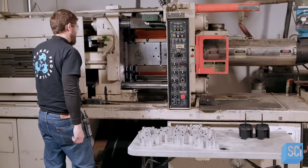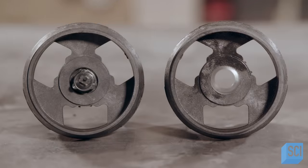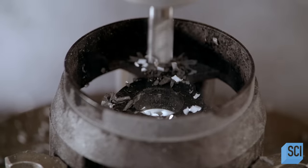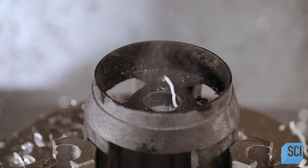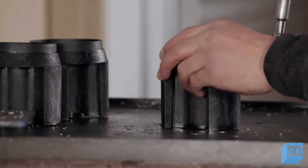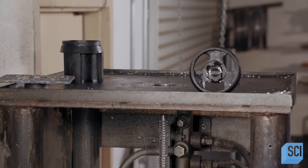He activates the machine. Molten fiberglass and resin material flows into the mold cavity and encapsulates the aluminum core. It also forms channels for the insertion of the propeller blades. Trimming will fine-tune the shape. A computerized milling machine moves the hub into position for trimming, and a computer-driven drill bores into the center to open up the hole. The next operation carves teeth that will mate to corresponding ones on the motor shaft — this is called broaching. A machine pulls a spiraling tool called a broach through the center hole of the hub, carving through the composite layer and into the aluminum core to cut the teeth.